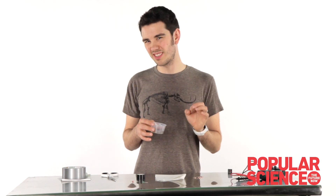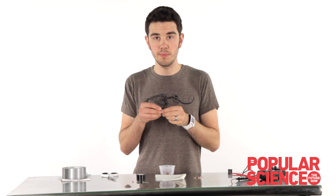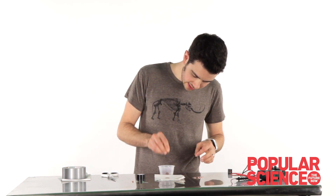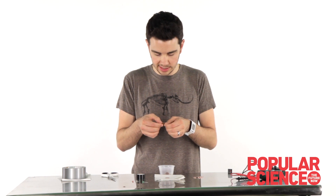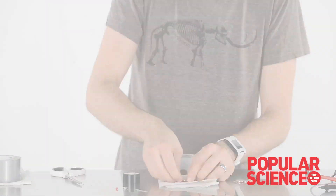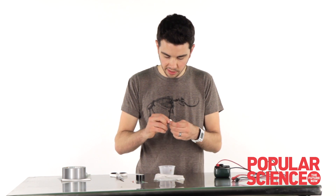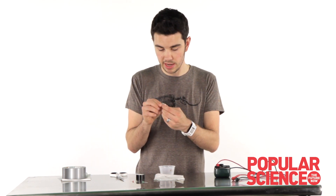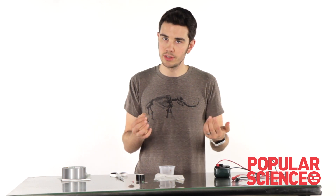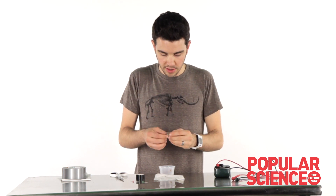So now we've got seven little cardboard discs, just slightly smaller than a penny, and they've been soaking up the lemon juice and acid that we need to drive this reaction. We're going to start with a penny, put it zinc side down, copper side up — a little napkin helps if you've got one. Take one of these little cardboard discs at a time, make sure they're square — they'll probably fall apart a little bit in the acid — and just put it right on top. Then put another penny, zinc side down, right on top of that. Here goes the last piece of cardboard — again, zinc side down, and you want to end copper side up. This is what you're looking for: a stack of pennies with seven pieces of cardboard, one between each penny. Notice that the cardboard isn't sticking out at all on the edges — that's what you want, because if it's touching another battery you're going to lose current through the whole stack. You want to stack all that potential difference up and get a good current. That's the penny battery.